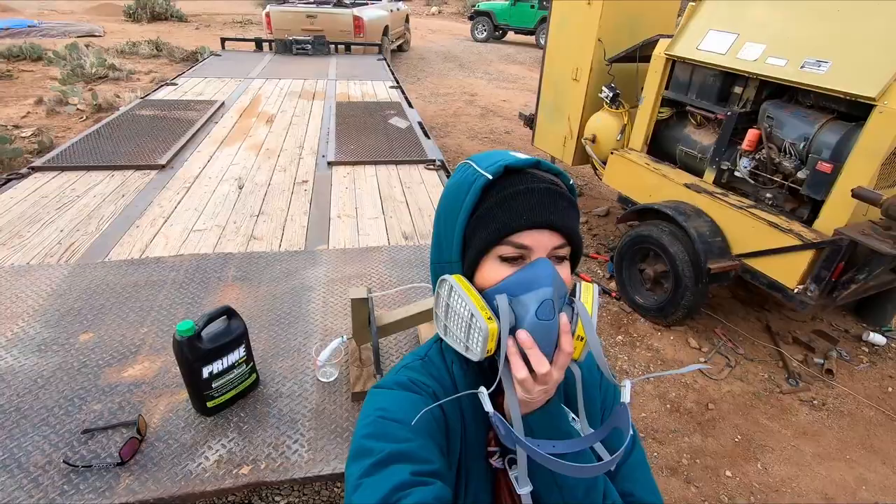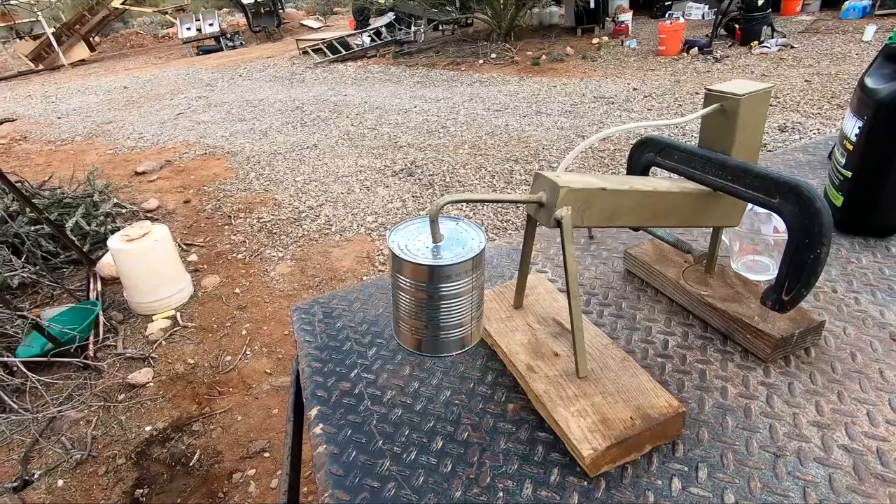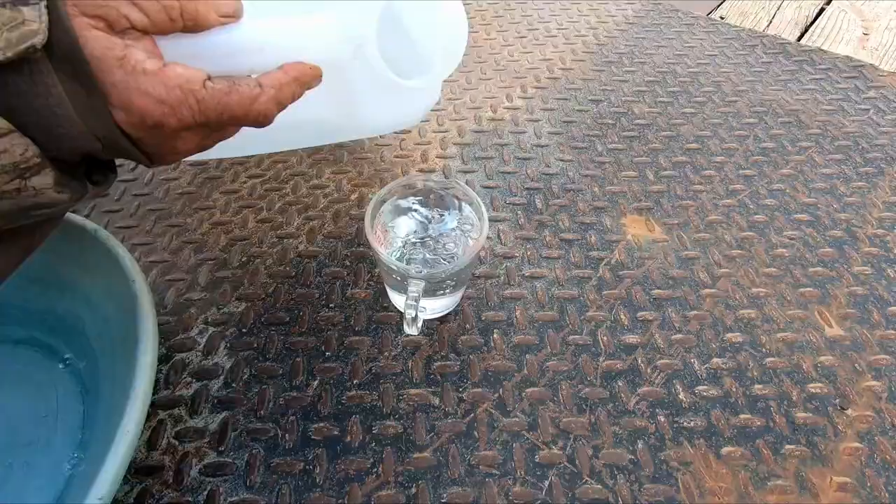The purpose of this is the water in here is going to wick up this cloth to keep it cold so that the mercury can drip down into this. We'll put water and antifreeze inside. And then I have my gas mask — trying to be legit. I wanted to be safe, so I moved to the other side of the retort to make sure I was going to be safe from any fumes that might escape. Also, the gentleman that is helping me has never done this before. This is his machine and he wanted to learn how to do it, so I did the research and I'm going to figure it out.